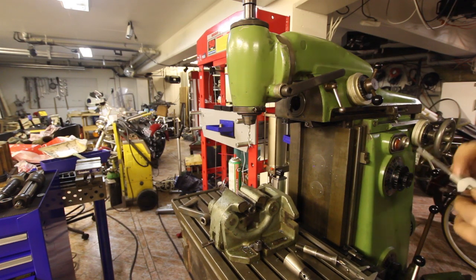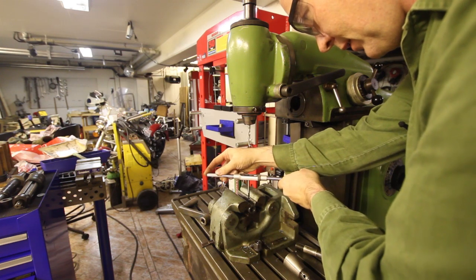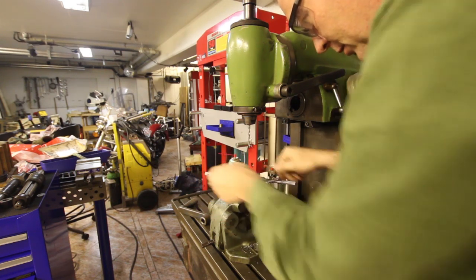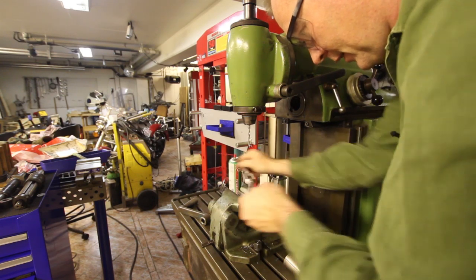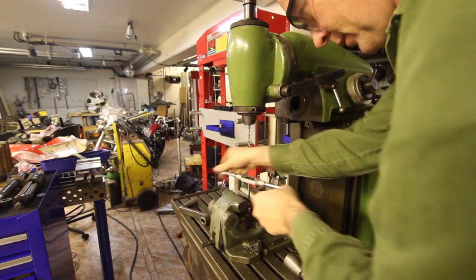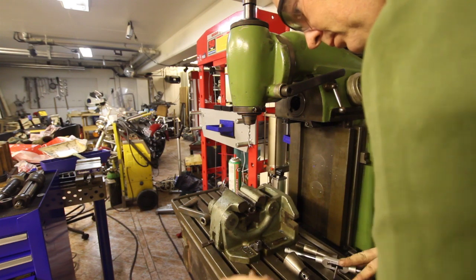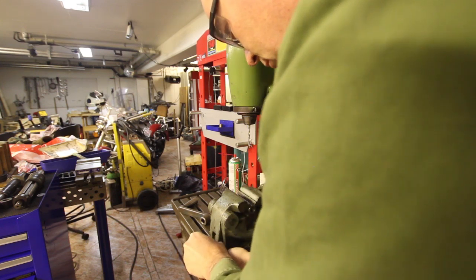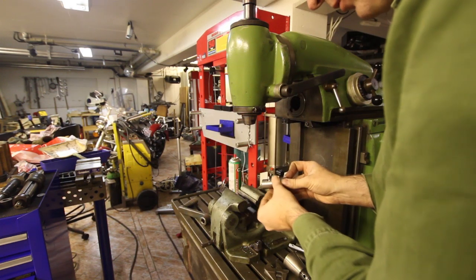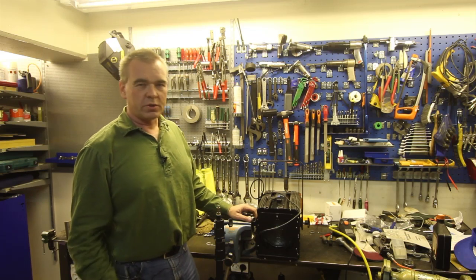Okay, that's the hole, and now I'm going to tap it. I don't have a tap follower, so I'm just going to do that here, since it's all clamped up real nice. Again, using a spiral tap, which I like. And that's it. Hole tapped from the side, the flat surfaces, M10 hole, there we go. That was all the machining.